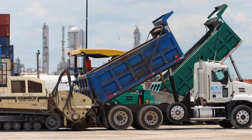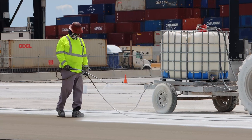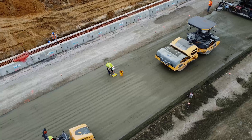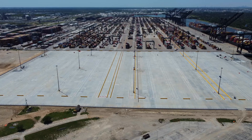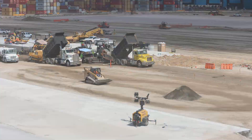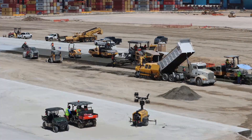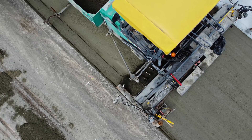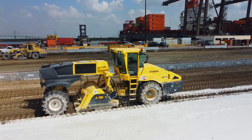A bobcat usually runs around picking up RCC that was dropped by trucks or the conveyor feeder. Curing compound is sprayed on the surface of the top lift after the roller finishes compaction — it prevents evaporation of water from the concrete. Pavers are guided by lasers along a pre-established lane line, and placed material is frequently tested to verify its density and moisture content. The RCC paving process is extremely quick and efficient. In one day, pavers can easily place 1,200 feet of 18-inch deep, 30-foot wide lane — an insane production rate. Even though RCC can withstand significant loads, it does require extensive subgrade preparation, though this is the same for both RCC and traditional heavy-duty concrete. I have a separate detailed video on how subgrade is prepared for placement of 18-inch thick concrete for a container yard — check it out if interested; the link is in the description.